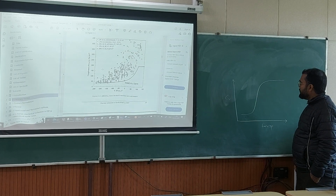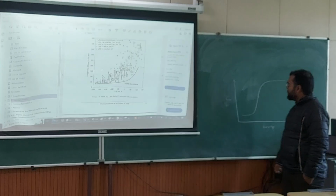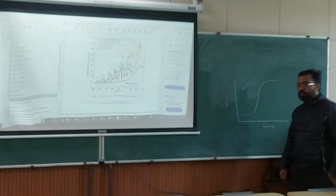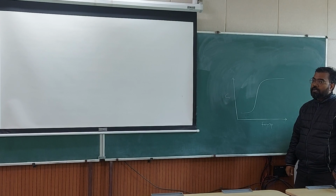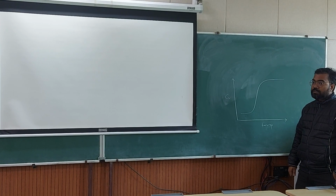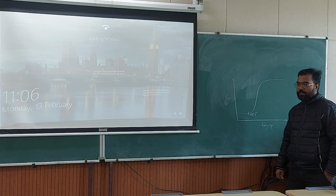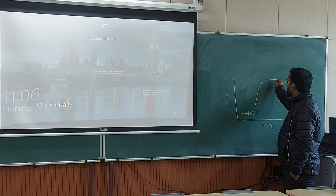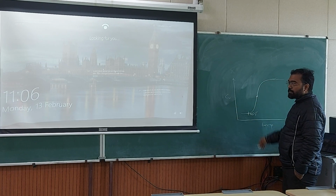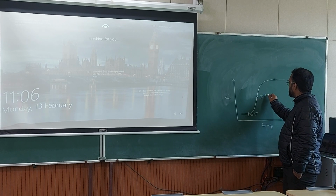And so in lower shelf you don't have much scatter, in upper shelf you don't have much scatter. And the value or temperature below which you can see from the data that there is no ductility at all, not a significant amount of ductility, that temperature is called nil ductility temperature, NDT. Okay, and the median, so lower shelf and upper shelf and the middle point of that will describe 50% chances of ductile or brittle, so that is called DBTT, ductile brittle transition temperature.